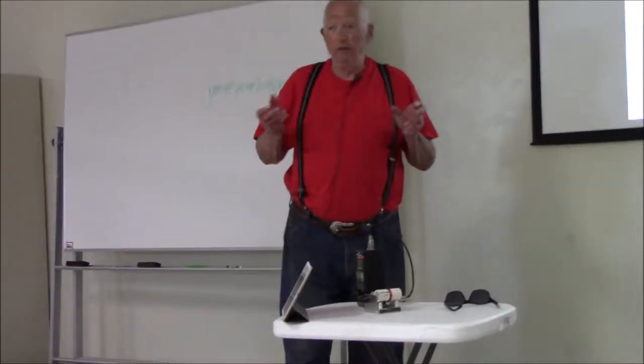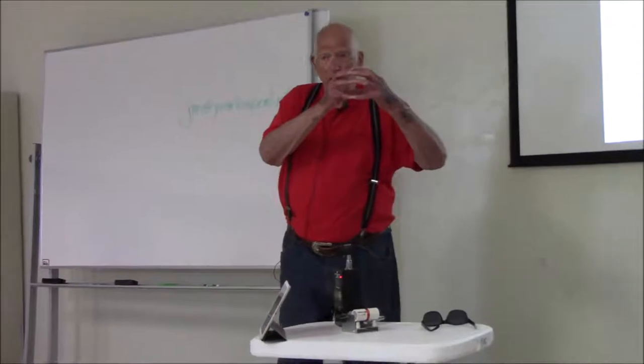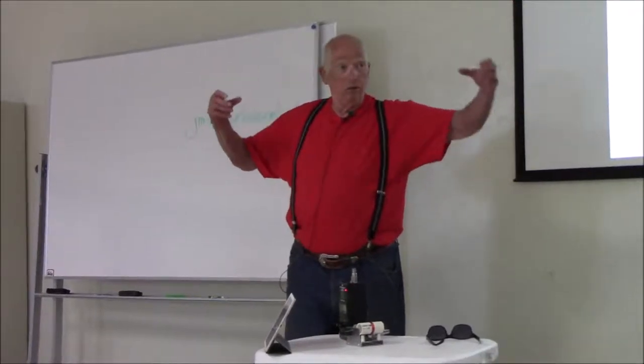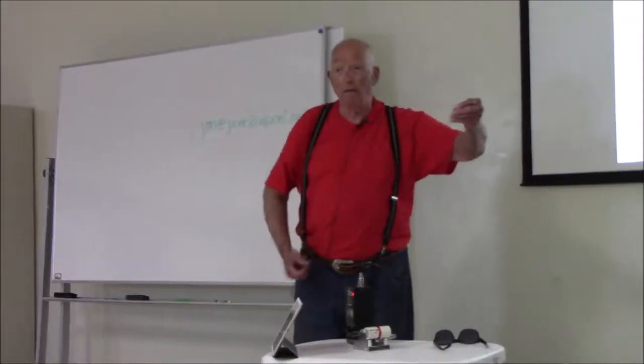So one of the things I want to do here really fast is quickly define a few terms so that we're all kind of on the same page. We've already talked about electrons, and we've talked about charge being a group of electrons. We talked about voltage being the attempt by the electrons to spread apart, or the difference in potential between here and here, where I've got a lot of electrons here and none here, and they all want to go over here if they can.